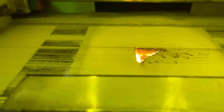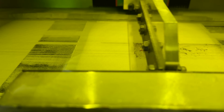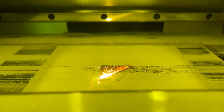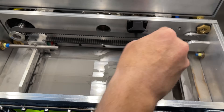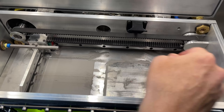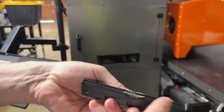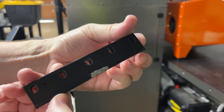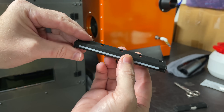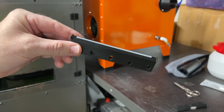Now that it's printing the solid layers — the part has clearly failed but I'm just watching to see what happens. It looks like some of the pieces are actually melting to the silicone wiper. The powder is kind of balling up more than actually fusing together, so definitely some changes in the settings are needed. I'm really glad I went with this 3D-printed recoater blade with a silicone cord — this thing has been taking a beating with my failed prints. You can see it's time to reprint a new one before we move on. I've printed a new one and installed a new silicone cord.